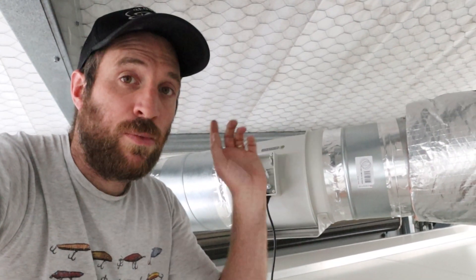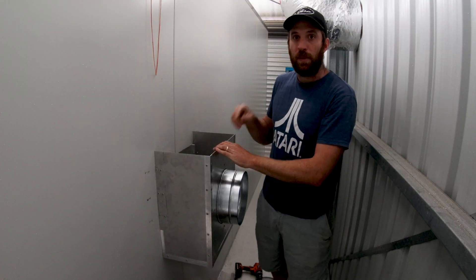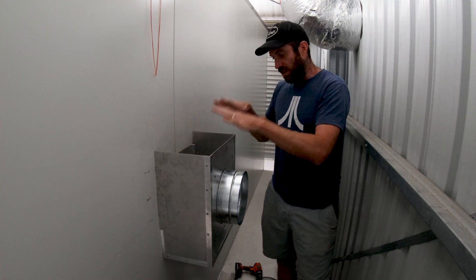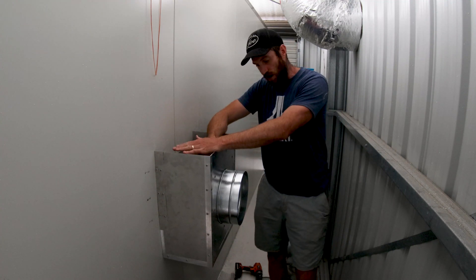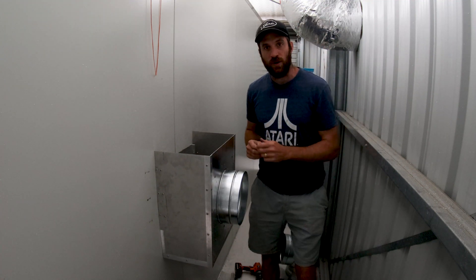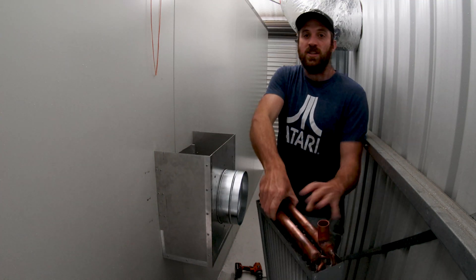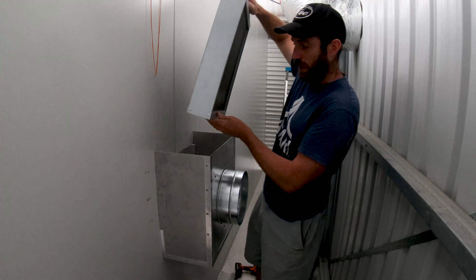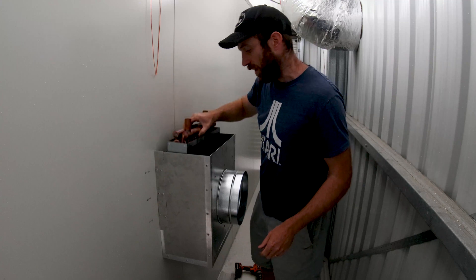We will have a look once we build the second part — the air extraction out of the fruiting room — and we'll discuss why that won't be the case. So we're at the back of my fruiting rooms here, and I am building our atmosphere extraction. This device here is going to house our heat exchangers, which will slot in. The cover will go over, and then this will twist up and go up to the roof, and push all that CO2-filled, spore-filled air out the top. This is one I've imported from China — it's far cheaper than buying anything local. None of this stuff is manufactured here in New Zealand.